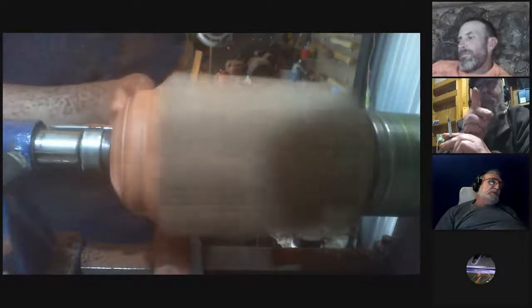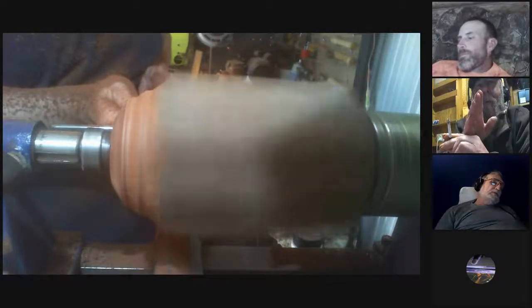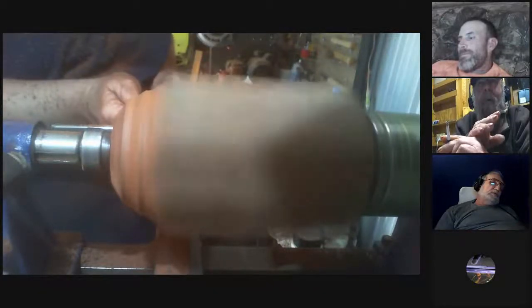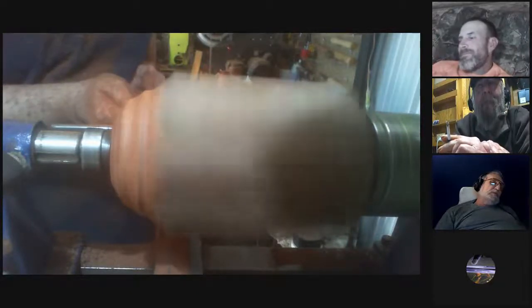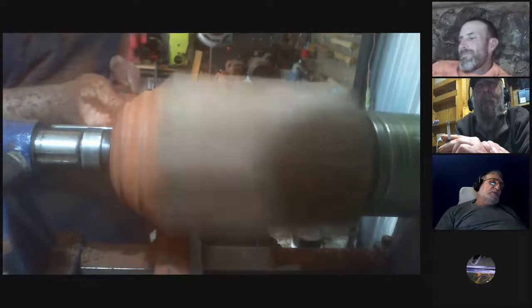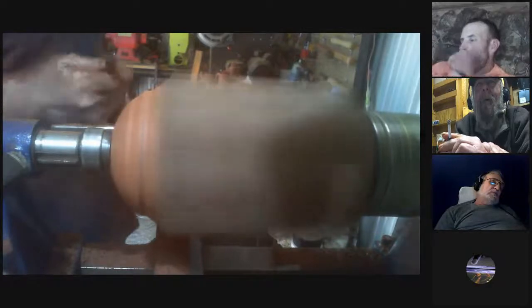Right, stop cutting there. Drop there. Now come back a bit more on the round bit. Slow down the depth of cut. You're taking too much out of the time. Now start bringing the chisel handle around towards you, very slowly, and lifting the handle at the same time, and twisting the tool at the same time. That'll do, leave it there.